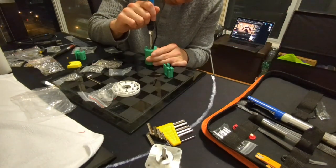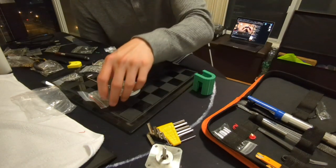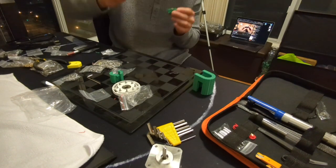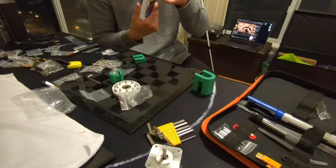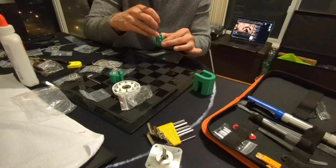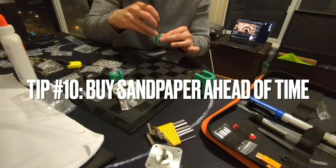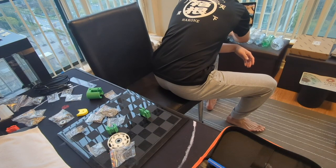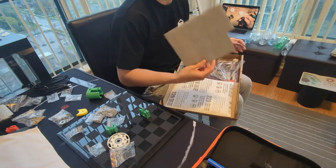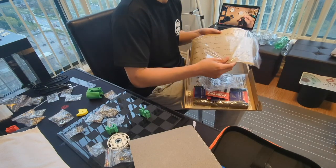Now it's about assembling the different pieces together onto the main Polyformer body. We're going to start with the polycutter. The latest version is the polycutter light. The final assembly of the polycutter requires a little bit of sanding, so buy sandpaper up to 600 grit. The sanding is mainly for the bearings, which act as the blade to cut the water bottle. There are videos for how to assemble them. I recommend going from 220 grit up to 600 grit.